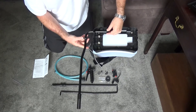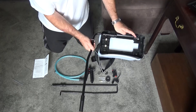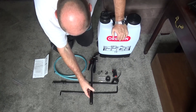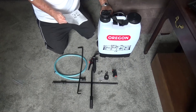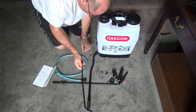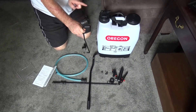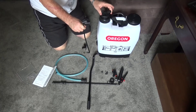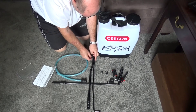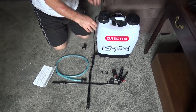Now there's another little bracket at the bottom of the sprayer. That's got the lever and it's fixed tight, so I'm going to flip it back over. The next thing is to attach the connecting rod to the rocker bar. When you put in this bar, make sure that the top bit — which is the longest — is pointing towards the pump. Push that through, then the washer goes on and then the split pin. So that's fitted.